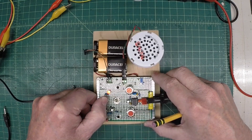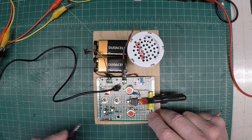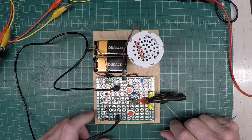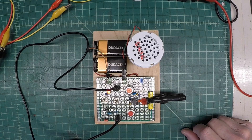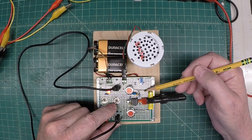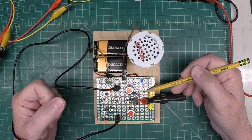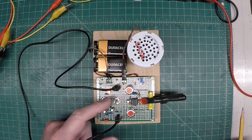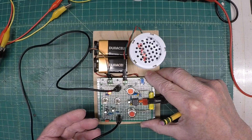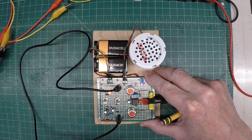Let me flip this on and plug it in. This would be my original input source, and this is the white noise generator itself. I'll toggle back and forth here. This is the foil side, or the outside shield of the capacitor, where we have the loudest amount of noise occurring, the way we have the switch configured. So it was a quick and simple way for me to add this on board without needing my iPhone or a separate signal generator.